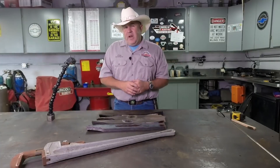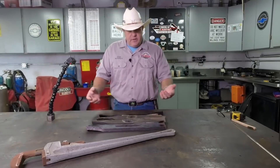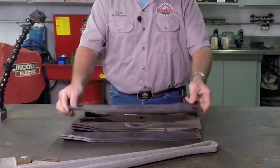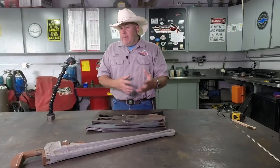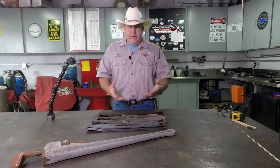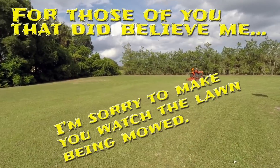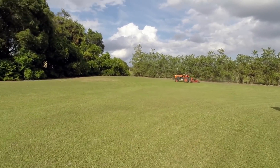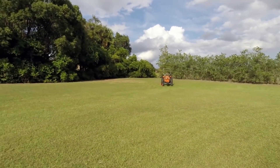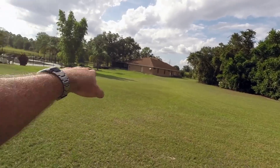So I've got the blades to $3 a piece and it takes me roughly 15 minutes now to stamp out a set of blades. Here's a set that has not been ground yet. To stamp them out with the ironworker, put the bend in them, and sharpen them is maybe about 15 minutes a piece. A lot of people commented that they didn't actually see what they looked like or didn't believe I was being honest that they did a great job. So here's some video of us mowing the grass. That's my son Beau — he's mowing on a Kubota L245, a basically 25-horsepower diesel two-wheel-drive tractor pulling a 60-inch Kubota finish mower, the RFM60, with the blades we made on it. As you can see it's doing a real nice job — it looks like a golf course.